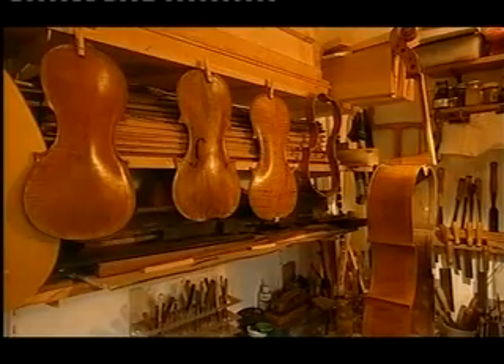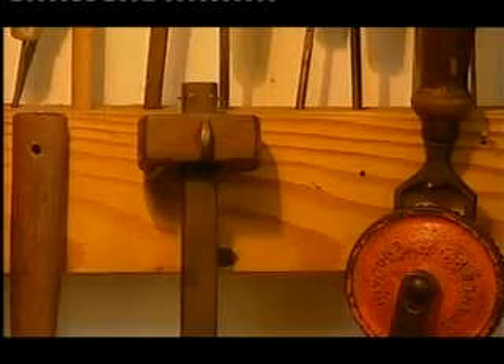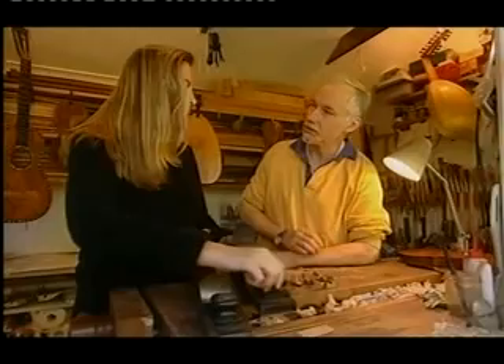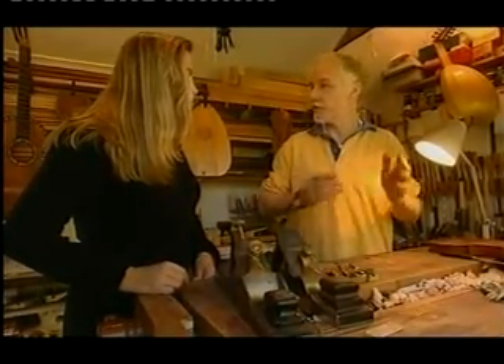I've always tended to use hand tools and, over the years, I've nosed around and found the most efficient ones I could possibly find. It ends up being that the tools they used when there were no power tools are still the most efficient hand tools. This is an old Scottish panel plane — it's a work of art itself. Just feel the weight of it. It's perfectly balanced, but it weighs a ton. Which means, once you get it moving, the momentum's incredible and it doesn't chatter, it doesn't rub — it does nothing apart from cut wood very, very efficiently.